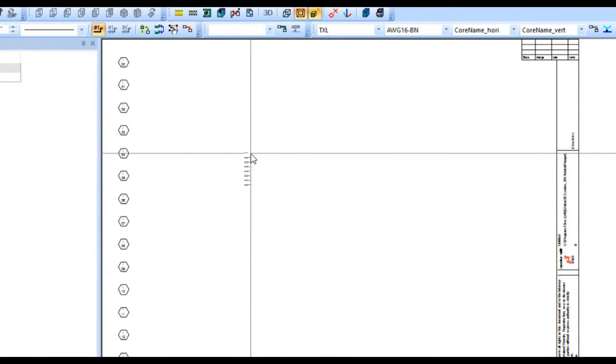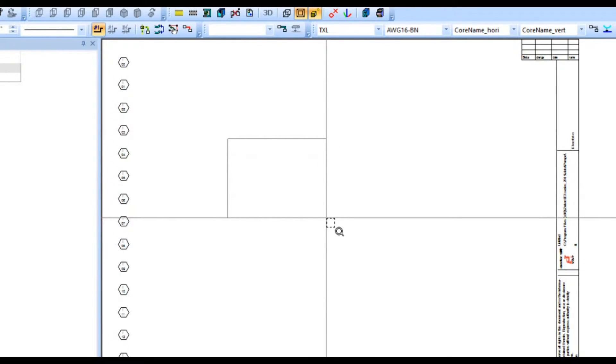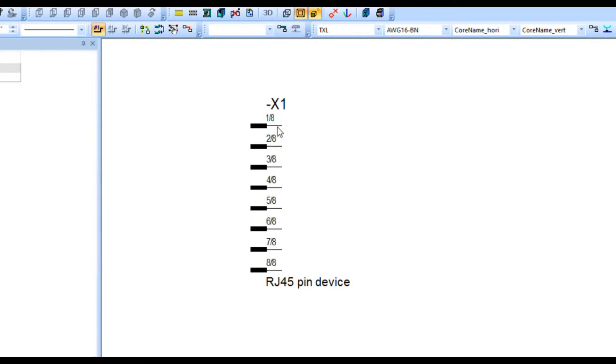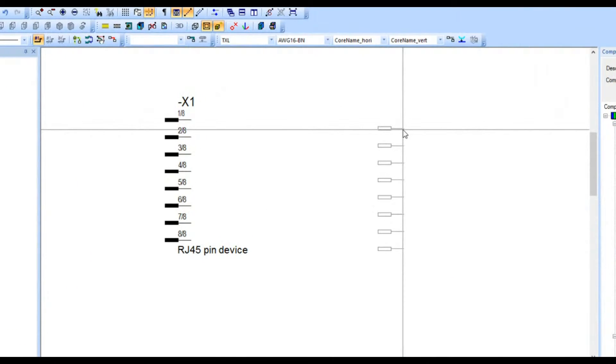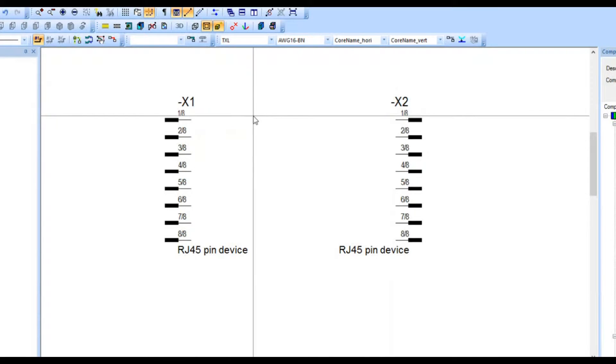Like every other tool there are zoom features — I'm going to hit my Z key, and where the top left of my cursor is, that's the start of the zoom. I pull my cursor down. Nice thing is I didn't have to stop my placement; it allowed me to do the zoom and then resume placement without bailing out of the last command. I'll click down and place this. Then I'll place a second one — right-click, place single pins. We have X1 here, and once I do my rotation we'll see X2. I'm going to hit the Y key to flip it along the Y axis, bring it in, and drop it. Now we have X1 and X2 — our two RJ45 components.